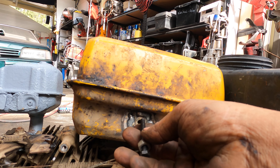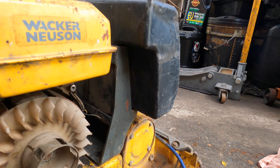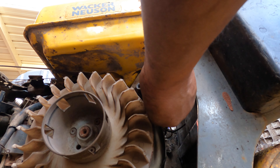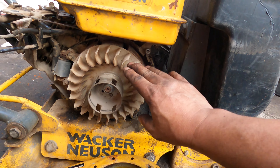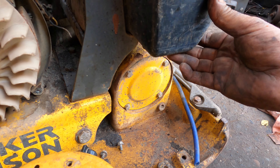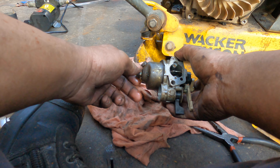I'm making an M6 thread go in here and welding with my beautiful welding technique on the MIG welder. Just one bolt and it's already tight. Make sure you always have a spring washer — with all kinds of vibrating machines you know what I mean, they're shaking a lot and bolts can come loose anytime. All vibrators have to have spring washers. I'm gonna get a new switch, put it in here. Also use an extension bar number 13 to go down and tighten them up — you can take it off and put a spring washer on, no worries about vibration.